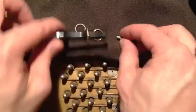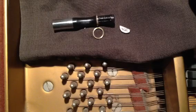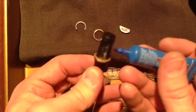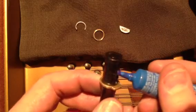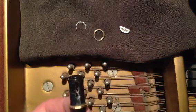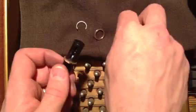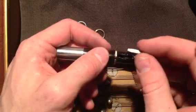Replace the bearing — or excuse me, replace the key. The best way to do this is to use a small amount of high-strength thread locker, just a little bit once again. Put a tiny drop on either side, and that'll get squeezed in and ensure that the key doesn't work its way out while it's being used.